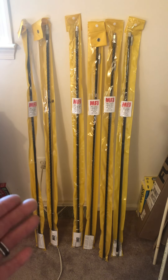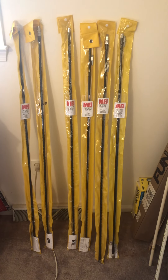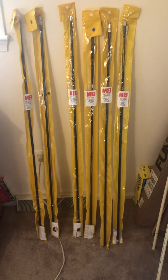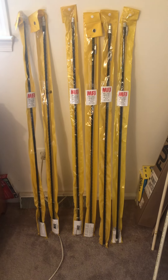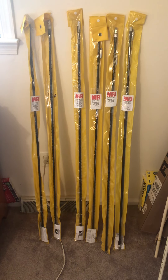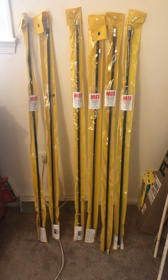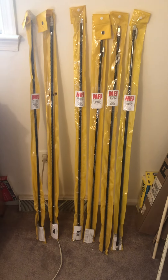I had a couple videos this weekend where I was using the 20 meter one, and I showed you the 75 meter one as well. So if you're in an apartment and maybe you have a porch or something, I'm thinking you can get a little vice grip mount mounted to your patio railing, maybe get a little bit of 18 AWG or 20 AWG wire, about 10 to 15 feet as a counterpoise, and work HF right out of your apartment.